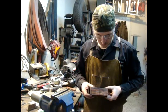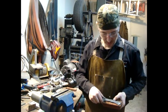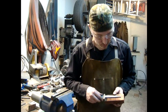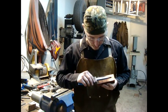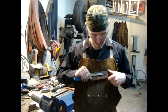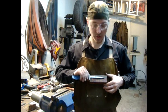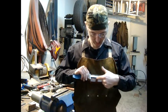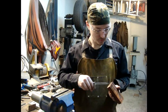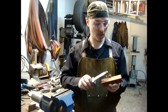I cut my block and cleaned up the face so I could see. I got my template I usually use for my handles — I traced that on there and set my knife so I could figure out exactly where the tang was going to be. I had to trim this part because it was going to be too close to the back of my handle. I'm pretty happy with that. I'll go over to my bandsaw and cut the block out to shape, then lay out for drilling the hole for my tang, and I'll show you how I hot-set my tang into my handle.